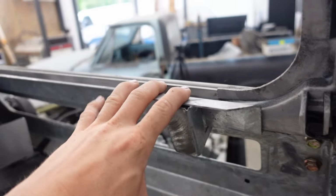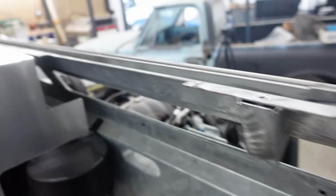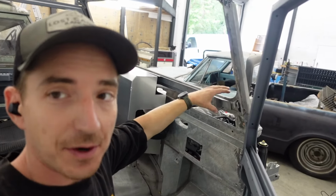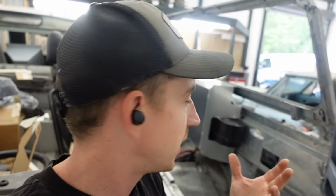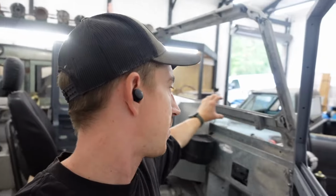The top of the dash is going to mount probably via some button head screws along that lip all the way across. And then I think we're gonna make a leather cap for everything to finish off the top. You aren't gonna see any of the hardware. That cap will fasten to the top of the dash, clean everything up. And then if these happen to be painted, we're gonna have the leather on top that's not gonna reflect the sun into your face, because you really don't want like a light colored paint or interior on the dash.